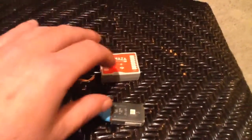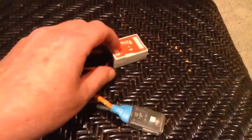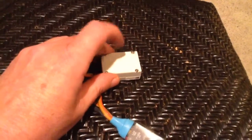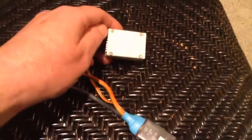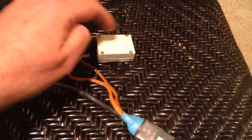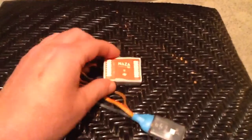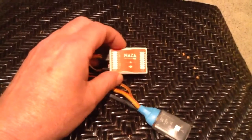What I also did to this, to make it even better — because the Nozzle Light has a problem with this white case having light come through it. If you take this case apart and put a flashlight on the back side and shine it through, you'll see that light just perfectly. So what I did is I pulled the four screws out, took the case off, and I painted the inside of the case on both sides black. That will take care of that problem — that's always been a problem with the Nozzle Light.